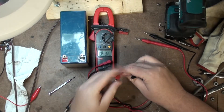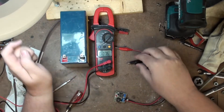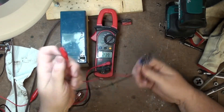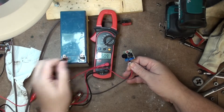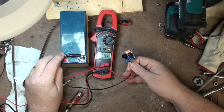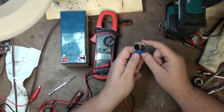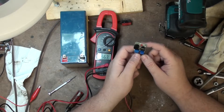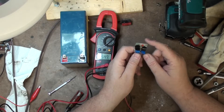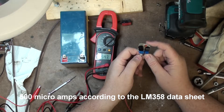Now I have a battery here that I already know the voltage is low on — 12.16 volts. So if we hook this up correctly, the alarm goes off. The voltage draw on this, when the alarm isn't going off, is very, very small. I'm not sure of the exact amount — probably around or less than 20 milliamps. Could be even lower than that. I'll check the specs and post them in the video.